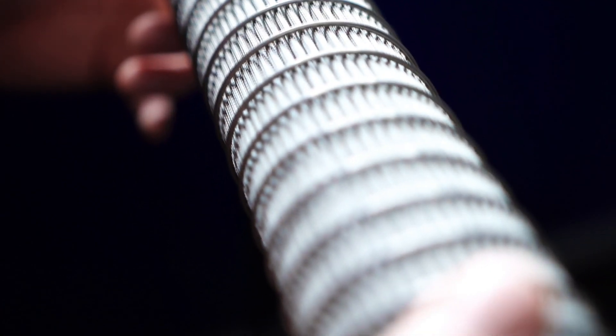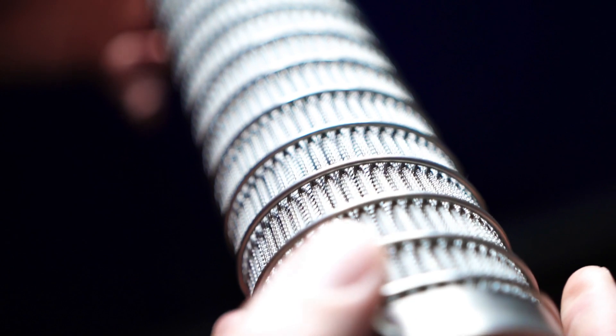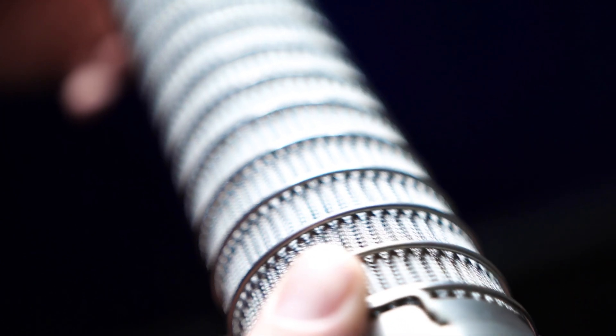One notable limitation associated with wire mesh filters is how much wire mesh can be drawn when being formed into a deep-drawn filter. The ratio must be followed to ensure the mesh is not drawn deeper than its diameter, which would damage the mesh and increase the size of the cut point. It's also important to know that a wide variety of metal mesh weave patterns can't be woven past five microns, which can be problematic when working with gases or gaseous particles that can typically pass through a five-micron filter.